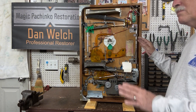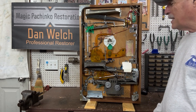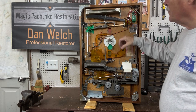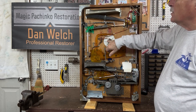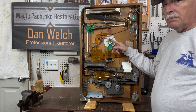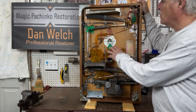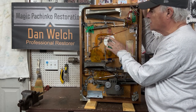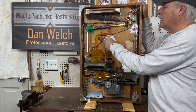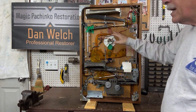There are a lot of parts here, there, and everywhere on this machine, and I do my best to take pictures, especially on a machine that I'm not that familiar with. This was a challenge to put back together again — I'm glad I had a lot of pictures. But we got it all wired. This center attraction features three bulbs, so it lights up really nice. The problem is that the 12-volt bulbs are a little bit bigger than the 9-volt or 10-volt bulbs that were originally in it, so you can't get this piece that holds the three bulbs quite in far enough for this cap to snap shut. But it does not affect the light or anything that shines through.